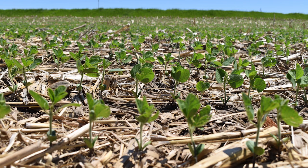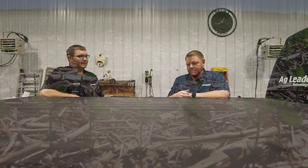The spacing when we saw these beans come up was mind-blowing, unbelievable. Watching the monitor going across the field, we were looking at singulation on soybeans somewhere to the tune of 99.1% to 99.7% — just boggling my mind that we could singulate beans that well. It's actually a popular misunderstanding because soybeans naturally singulate very well. In a vacuum meter with a round seed and a round hole, they do singulate well. The challenge the industry commonly refers to is really the spacing: beans are at a higher population, they're round so they roll within the trench. It's really getting them out of the system into the ground so they're not rolling into the seed before or after, to get that picket-fence stand. That's the real challenge.